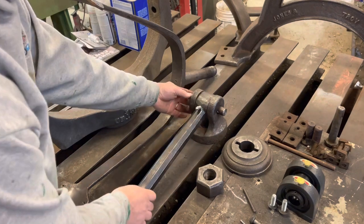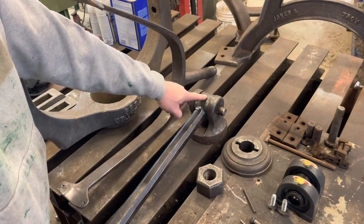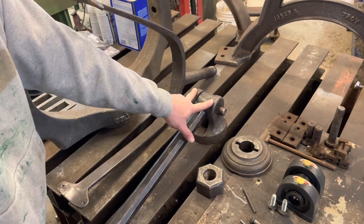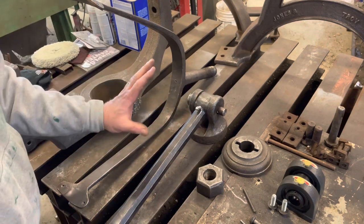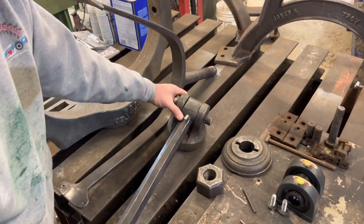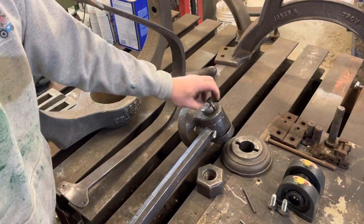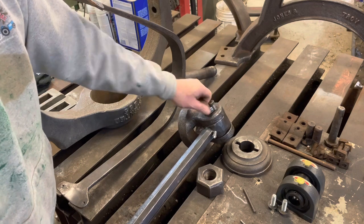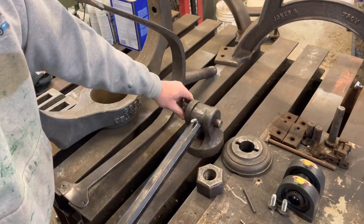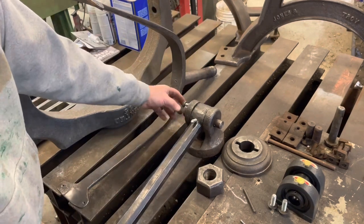This is greasable and is a pretty nice fit — not super tight, but it's a good working, clean clearance fit. But now all that's going to do is, because this is tighter and the knees are looser, it's going to cause the pin to just spin in these two and wear these out. As much as I didn't want to re-engineer anything on this — because I think the old boys had it pretty much right — I went ahead and tapped a hole there, put a notch in that pin, put this shoulder screw in. You tighten it and the pin is still free to move, it can still wiggle, so it should never seize up. Even if it got rusty — which it really can't because it's very well protected from the weather — but now the pin can't rotate. It's locked.